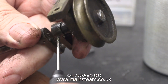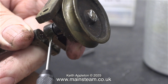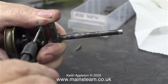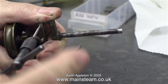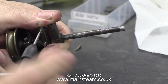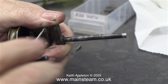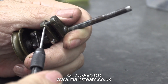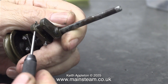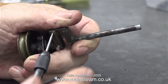There are benefits, however. A 1/16 of an inch drill bit is ever so slightly small for an 8BA tap to go through. You need a touch like a midwife for this job — you've got to be very firm, yet very gentle. It's one turn in and one turn out to clear all the chips. I frequently withdrew the tap and cleaned off the chips. Shortly I will show how I did it using a toothbrush.